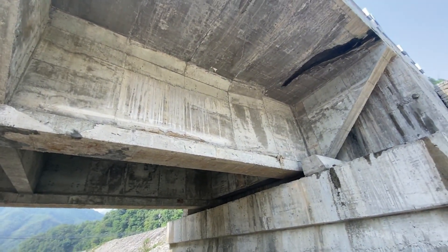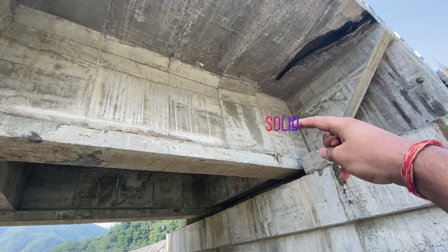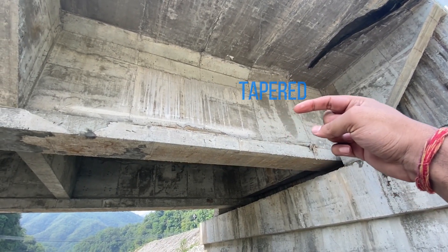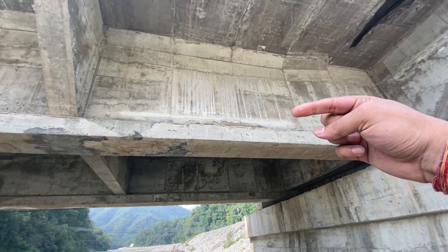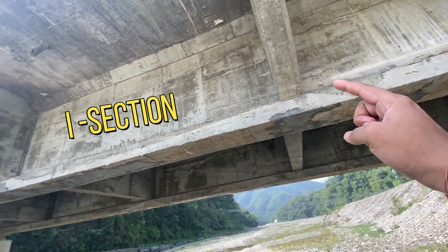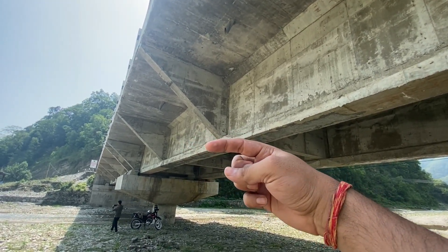As we can generally see, this portion is our solid section, part of our longitudinal girder. This is our tapered section — from this end to this end the section is tapered. Then we have the I-section running throughout the middle portion, and near the end we have again the tapered section.